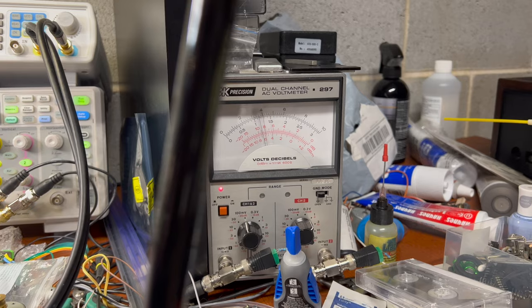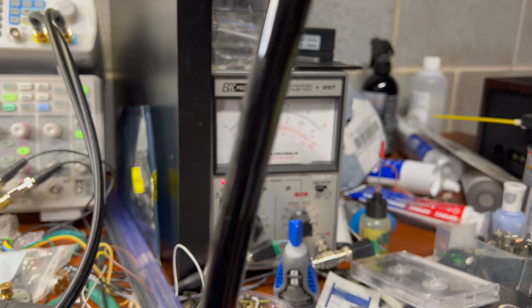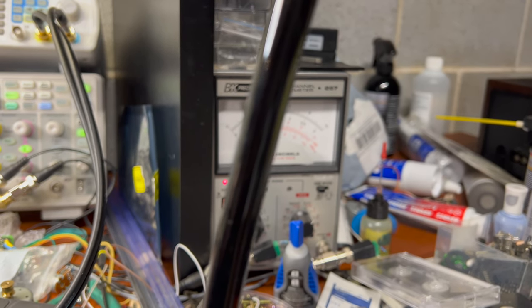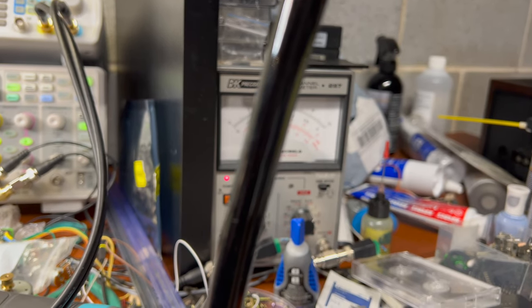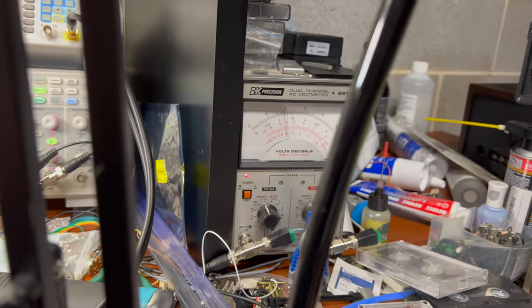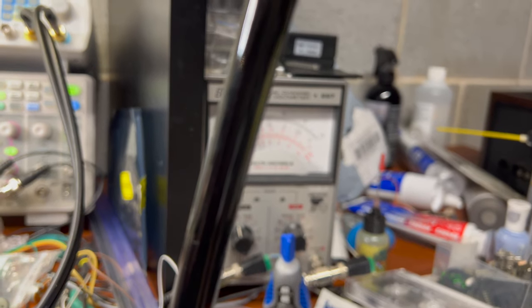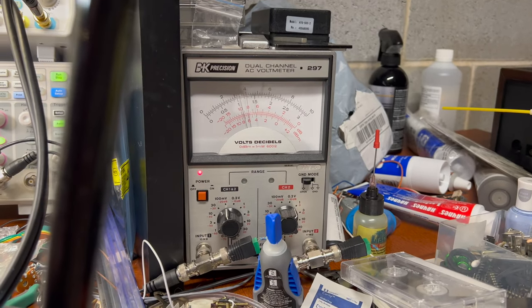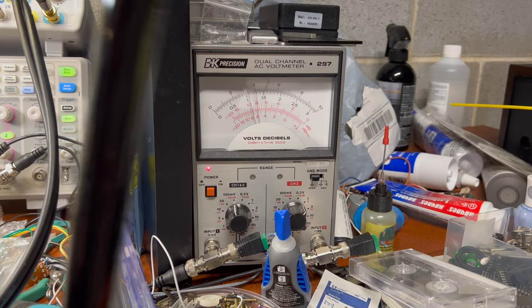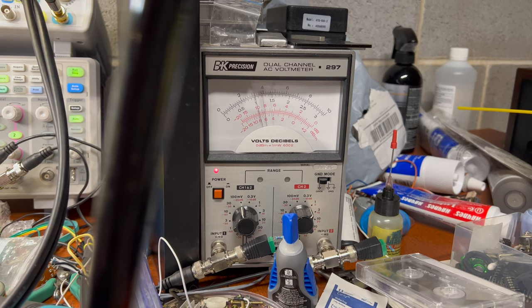Right channel is spot on. It's almost not moving. And left channel. Left channel has a drop on 400 hertz on the levels. So let me make sure that it will not be changing between 1 and 10 kilohertz first. Okay. Within like 400 hertz and 15 kilohertz. You see there is no change.